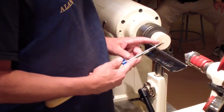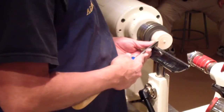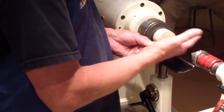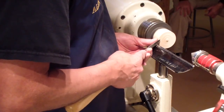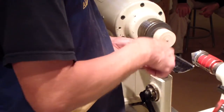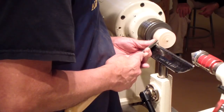What I'm going to do is touch the back of the bevel, the heel, to find that surface, and I'm going to shift my weight and find the cut. The flute, is it 3 o'clock or fully closed? Fully open, it's 12 o'clock, straight up and down, and fully closed. I'm going to slightly open it to find that cut. There it is, coming to the outside. This is the one time that I lock everything in position, and I very aggressively stick it in.